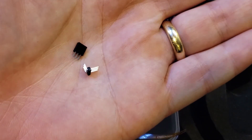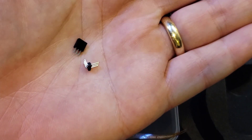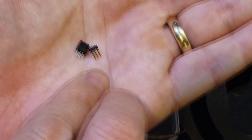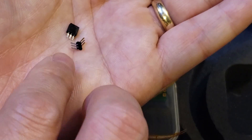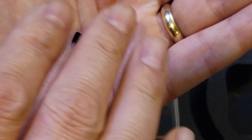So you do need these kind of specialized adapters to solder onto the PCB. By default, the main connector on the probe is an MMCX. You can actually desolder that connector from the board and use shorter headers instead — these headers are provided and you can solder them onto the probe. If you forego the MMCX connector, you can solder these connectors on, and that will further reduce the input capacitance down to about 1 pF.